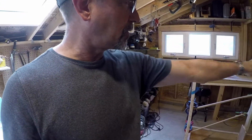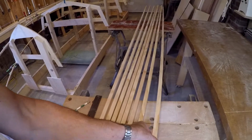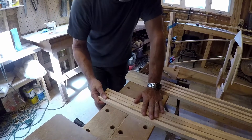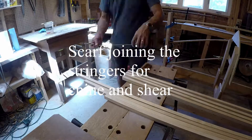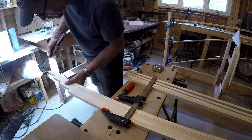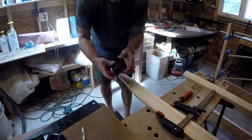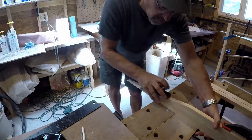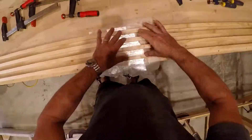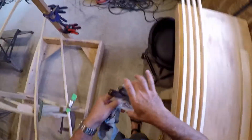In addition to scarf joining the two eight-foot pieces for our keelson out of half-inch birch ply, we've got these one-by select pine that will be installed along the chine and along the shear. I'm going to take four at a time and we need to scarf join these again — sort of a five-inch run. Stringers are glued and still running parallel — I think we got it.